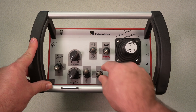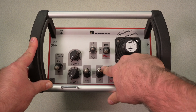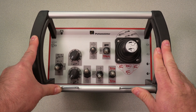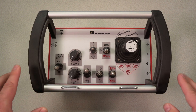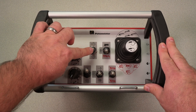This is the speed selector switch. Instead of a rabbit or snail, they use one arrow or two arrows. The one arrow is going to be the slower speed for your boom selections. The two arrows is going to be the fastest speed. The center is called user-defined — a selectable, adjustable speed mode that you can use this toggle switch to actually adjust.